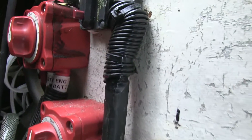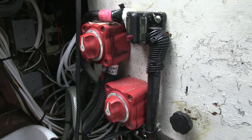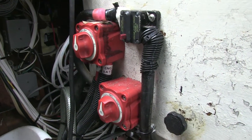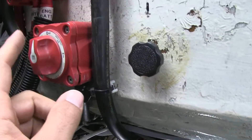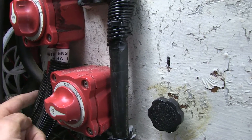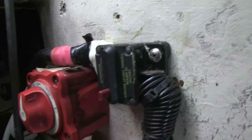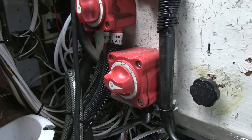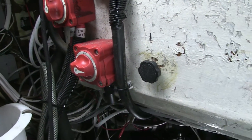What we've got here — we don't know who did this — but you can see this is actually the feed coming from the house battery. You turn it on, current goes here, goes to a breaker, then out and all the way back to the windlass.